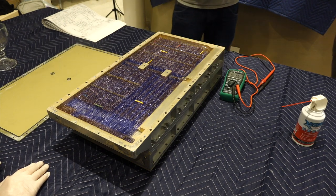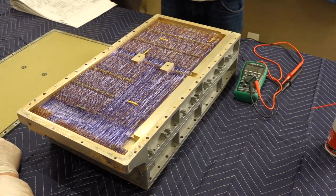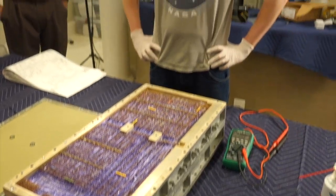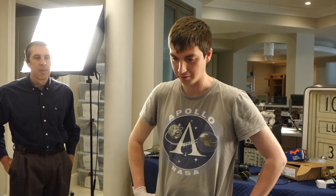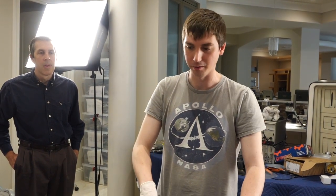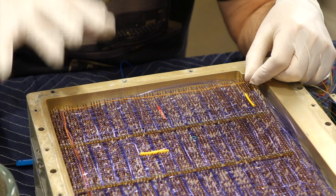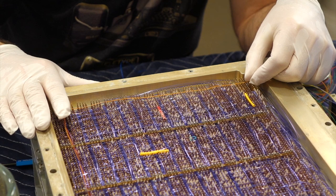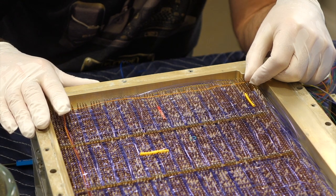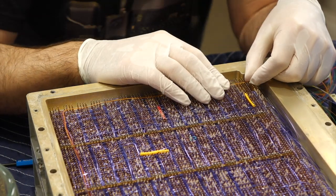It starts with us opening the backplane. So Mike, you are opening the AGC because you want to add a wire. Yes, we want to add a ground test wire that was present in the flight model AGCs that isn't yet in ours. Mike has reproduced a piece of test equipment that was used in the real test development of this AGC, but it works with a machine that has later wiring. So we are updating our machine, basically.